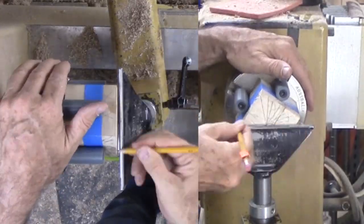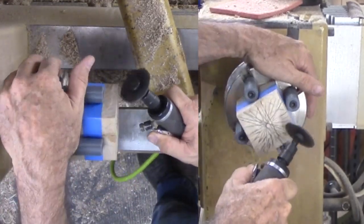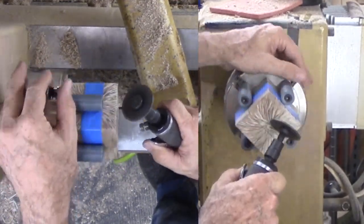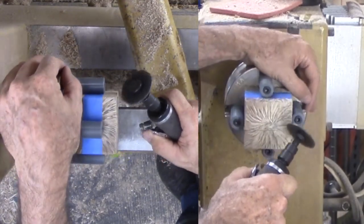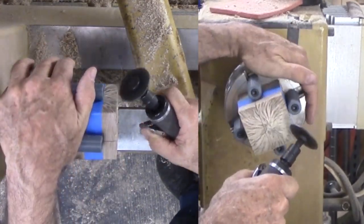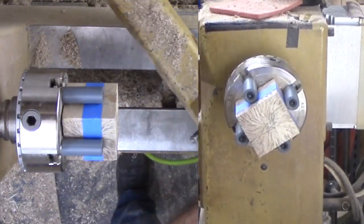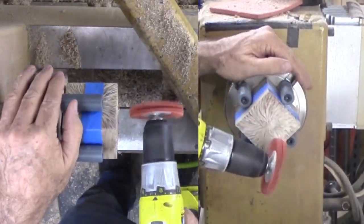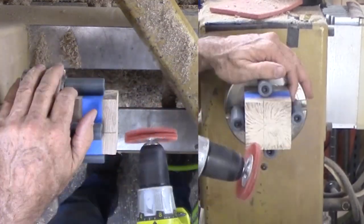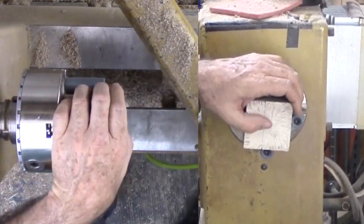This box seems appropriate for texture. To hold it, I am using the 50mm chuck pins and a 2-tip carbide tooth wheel. I take short strokes from the outside to the center while rotating the spindle by hand. It takes several rotations to cover the entire surface with the short grooves. Pencil lines provide some directional guidance — plus, when the lines disappear, the surface is covered. To smooth things out and remove chips, I mount an abrasive brush in my drill and go over the face again from outside to center. Repeat this texture on all 6 surfaces, then soften the corners with fine sandpaper.